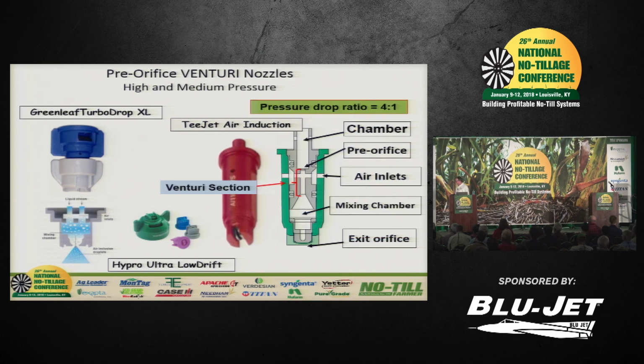The exit orifice is twice the size of the pre-orifice, and that has to be by design. If you have a small exit orifice, you'll back the Venturi up and it won't function. You'll also notice I've added up there what I said before. There's a pressure drop in that tip of about 4 to 1. One of the issues that first came around with this tip when it was used, we were so used to using low pressure, like 30 and 40 psi. When this tip went on the sprayer at 30 and 40 psi, the pattern was poor. It needed that higher pressure to get open. And I'll share that with you in another picture.